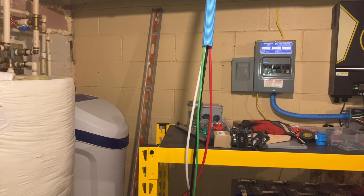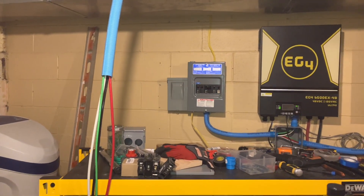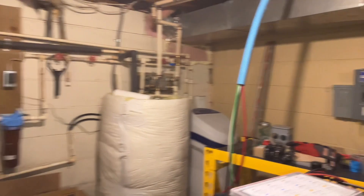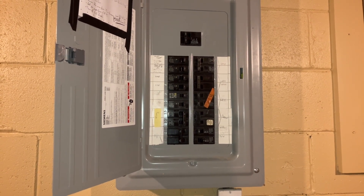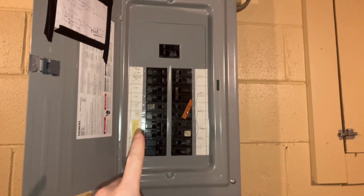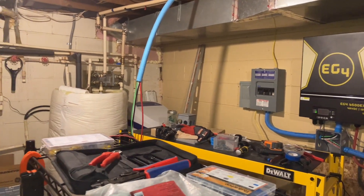When it comes time to hooking up the grid power, I can either pull a fish line to get my length before I order the line, or - since I'm looking to expand this panel to a larger size - I can potentially move some of the breakers over from this panel, thus freeing up some circuits in here. Then I could actually use my grid supply from here, feeding up and over to my box over there. That would significantly shorten my cabling needs.